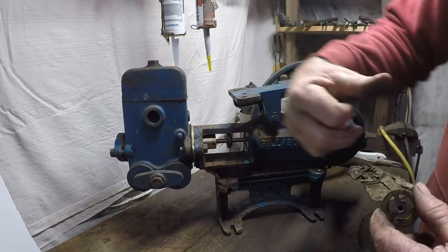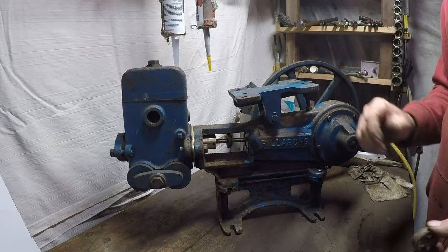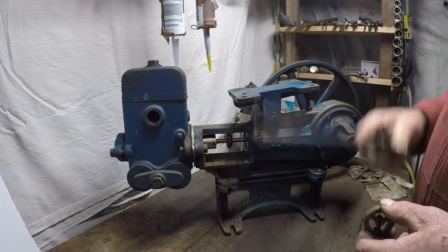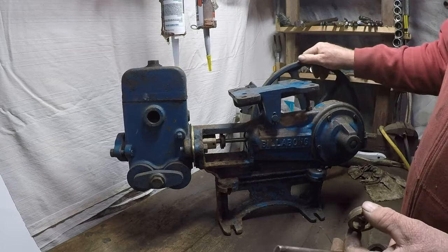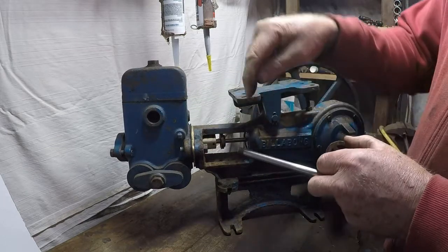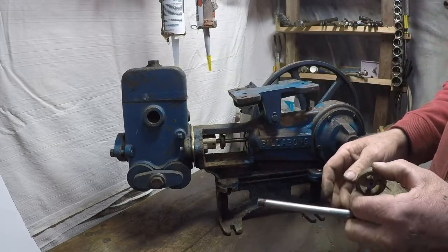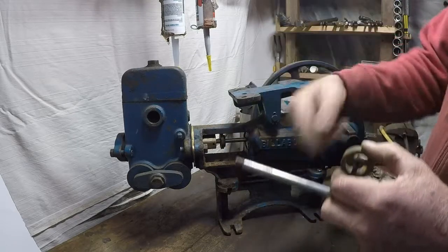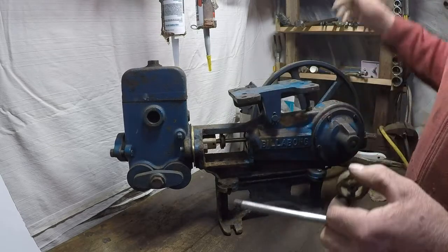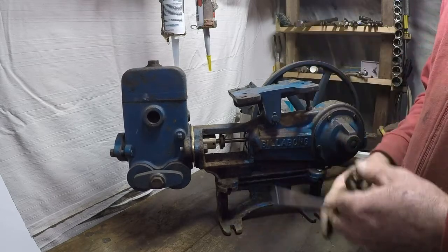Don't over tension it, because that's one way to ruin the bearings that the shaft goes through. It's just too much pulling on them, and you'll find that that's going to wear everything out prematurely on the oil end. Other things that can cause it is the wheel slipping. So if the wheel is not tightened onto the shaft enough, there's a flat spot on the shaft and the wheel screw sits on top of that. If for some reason maybe somebody's clamped the hose or the pump's really pushing hard, sometimes that's just going to slip around and it's just going to be moving on the shaft, and you think, oh, everything's running here, but it's actually not. It's the wheel's just spinning around.